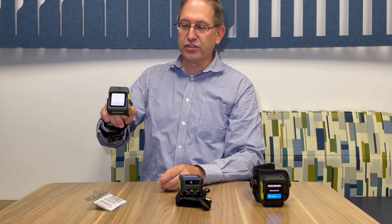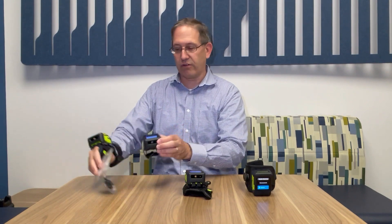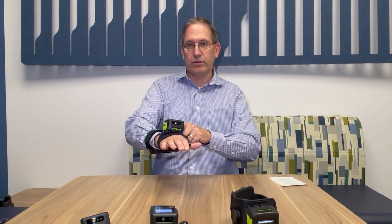All versions support both optical scanning in addition to UHF RFID. I have a few RFID tags here and I'm going to demonstrate how you can read upward and downward. In this case I have the upward facing antenna at maximum power, so it reads out to about a meter and a half.